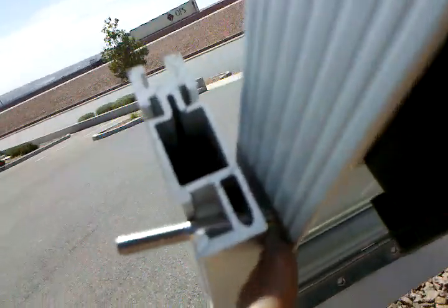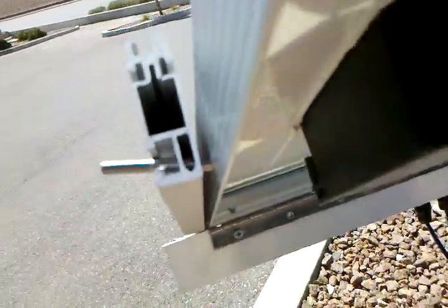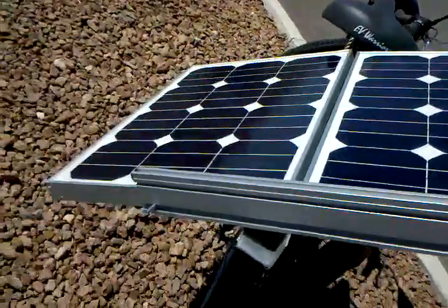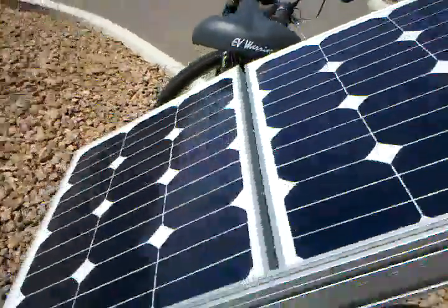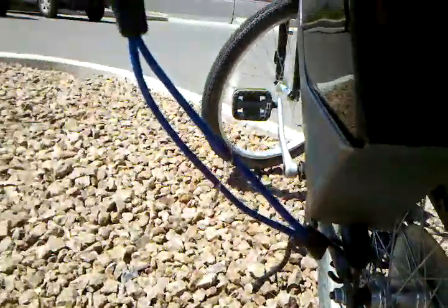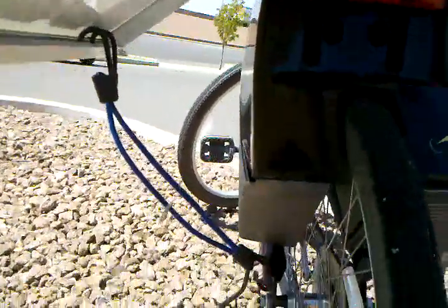I have just this one beam here with two pins — basically bolts used as pins. I'm going to get some bigger bolts so it stays a little bit straighter, but it's holding the panels in the same plane. Lucky for me, my latitude is about 32 degrees, and putting one bungee here against the frame actually puts the panels at 32 degrees up. In the summer when the sun is directly overhead, I'll put one on each side and keep the panels level for better power output.